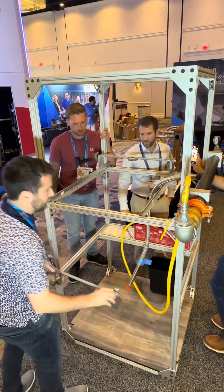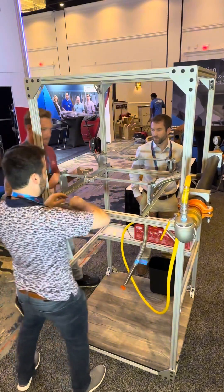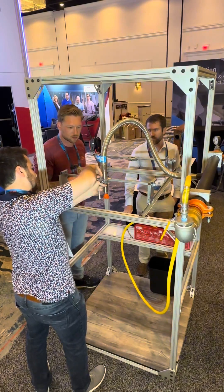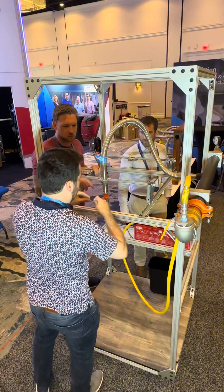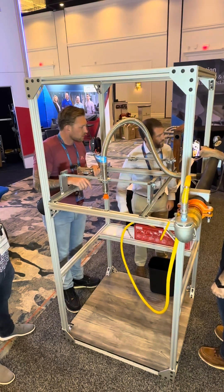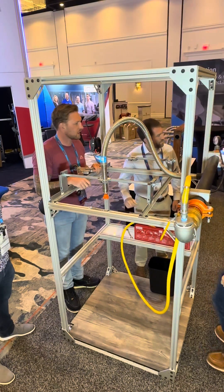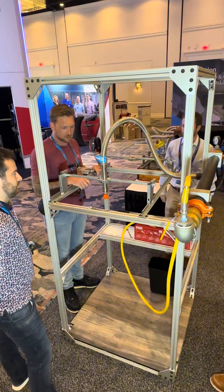So now we're going to actually put this bracket back on. Snap it into place. Drop it in just like our traditional FlexHead brackets. And you have markings too. Yes, we do have markings on the side. Quarter turn here. Going to go hand tight there. Take the wrench and tighten it up. Now we're sitting at 210 PSI. There's the sprinkler. No leaks. Nothing. And you are ready to go. No white bubbles. That's great. That's awesome.